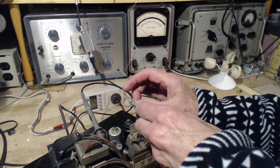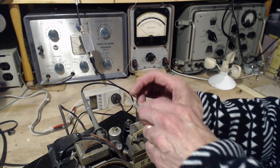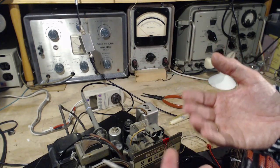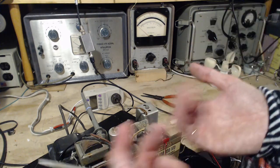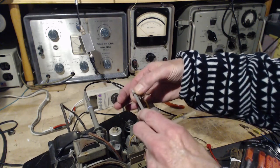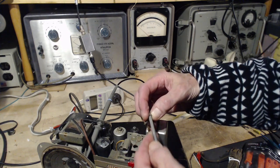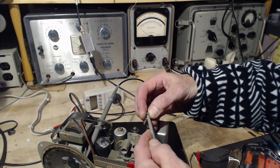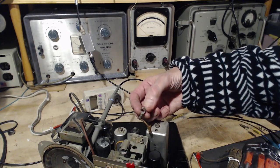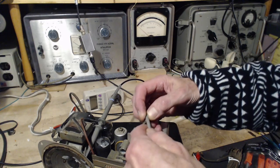Now, if you manage to abrade off all the zinc, or if the zinc has corroded away, then it's just steel. But what will happen when they plated the zinc onto the steel, some of the zinc atoms will have moved into the surface of the steel, and vice versa. Some of the steel will have moved into the layer out here. So just under the pure zinc layer is a layer of combined zinc and steel, some atoms thick. And that layer can be fairly anti-corrosive, if you like. So all I'm doing is just kind of buffing up the high points here. I'm not really scraping the whole thing, but what does it matter? Because only the high points make contact.